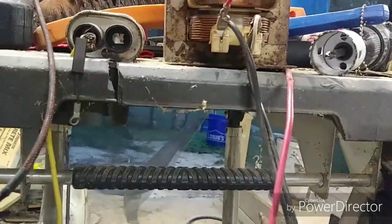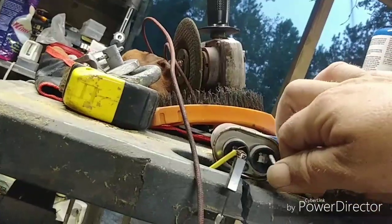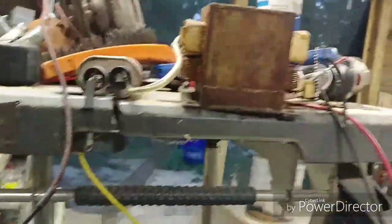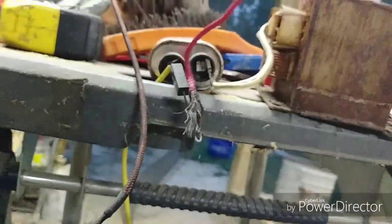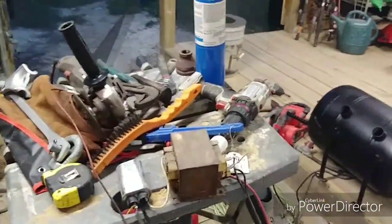As far as capacitors: you're gonna come out of your hot side here into your capacitor and out of your capacitor onto whatever you're burning. This is just a bleed-off resistor - once you're done, you want to hook this to the negative, set it on there and let it discharge itself. That way there's no large arc. That's basically it in a nutshell.